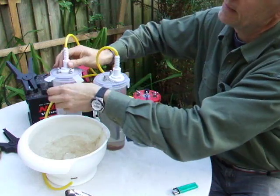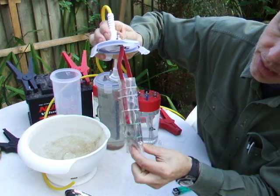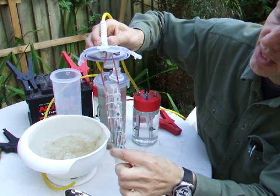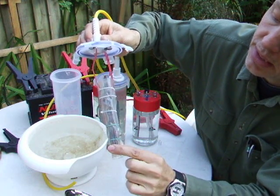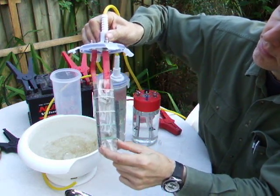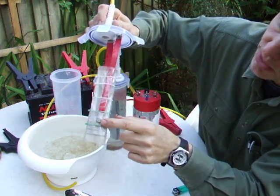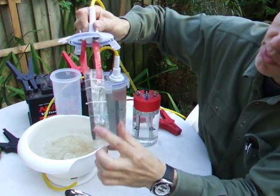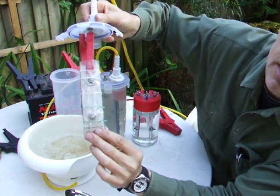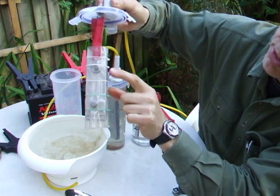Here's more or less the multi-plate unit from the manual. I have four neutral plates and a positive and a negative, where they're all insulated from each other. I put insulation tape on the strips of metal going down to each plate on each side — one goes down to one plate, the other goes to the next — and I wrapped it all in plastic to reduce current leakage to the water. The current-bearing plates are also a bit shorter than the neutral plates in the middle.